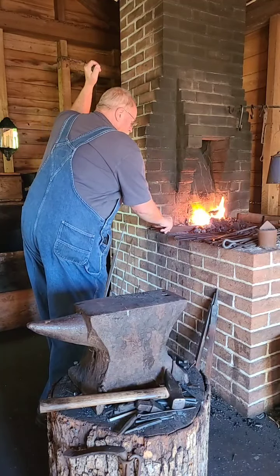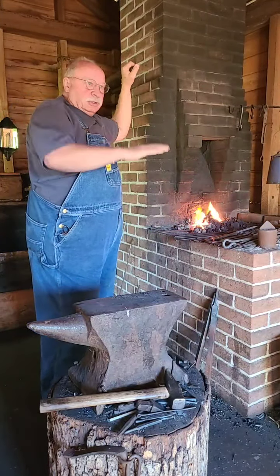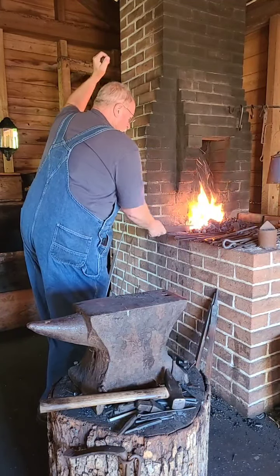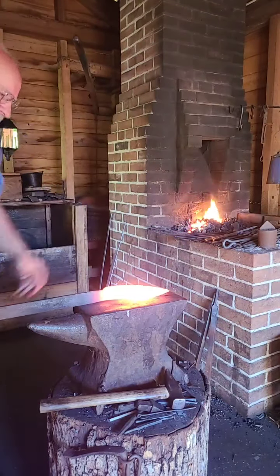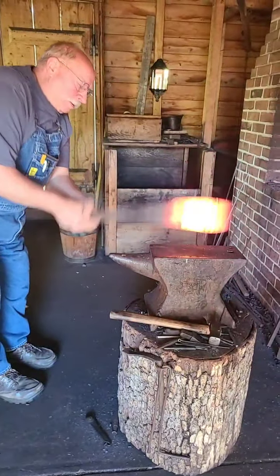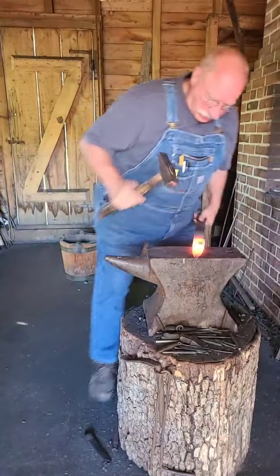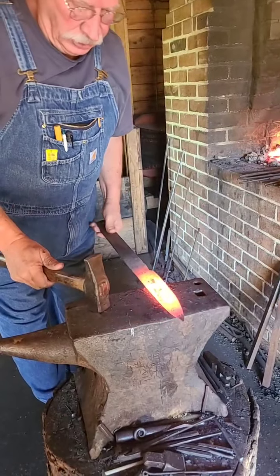I've got my hammer handy, but right now I just want to use the flat surface of the anvil. I am warming this thing up so the overall heat is throughout the length of it - the distribution of the bend will be throughout the length of it. Okay, here we go. A little bit of back and forth for the heat. I'm just going to gauge my height where my hands are and then whack it. I'm just using the weight of the piece to straighten it. It's a lot straighter than it was - it's crooked that way, we're going to fix that. It's got a twist in it.